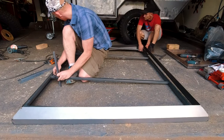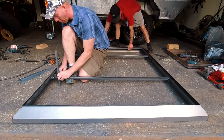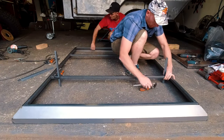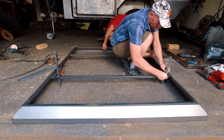If I had a nice bending brake press to fold full sheets of steel that would have been so much easier, as then I wouldn't have had to weld it back up and deal with all the heat distortion. The reason for going with this method was purely a case of working with what tools were available to me at the time.